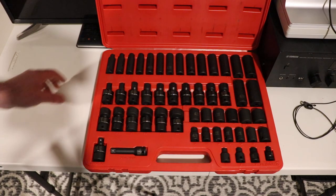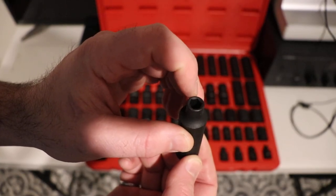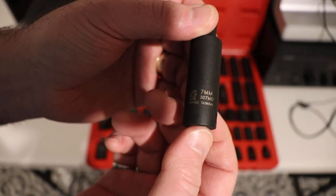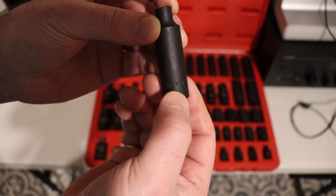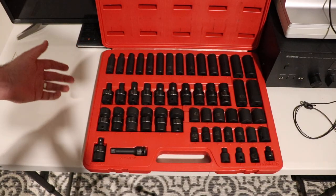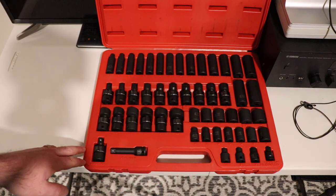When you look at these sockets, they're a six-point socket and the corners are rounded a little bit so that they can grip the fastener, which is a pretty common method. This is a 7 millimeter — it's a chrome moly socket. They're all made in Taiwan and they're stamped as well as marked on one side, so as the markings wear off you'll still be able to tell what sockets they are and put them in their own home. They're in a nice, logical order.